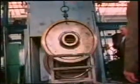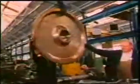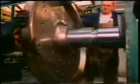These high-speed trains don't have tyres — the entire wheels are in one piece of tough steel. But the same technique, shrink fitting, is used to fix the wheels onto the axles. These wheels have been heated in an electric oven — they're accurately machined with centre holes just too small to fit on the axle. But when the wheel has been heated so that it expands, it will fit. They've got to work quickly — can you think why? And there it goes, neatly into place.